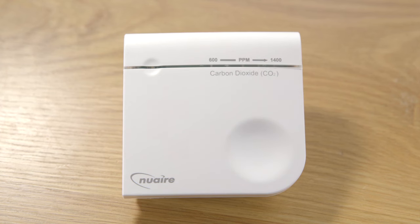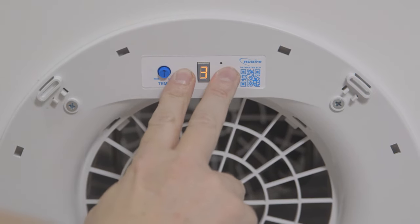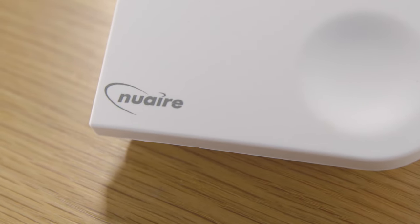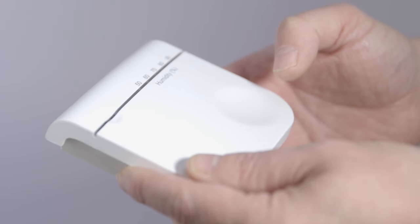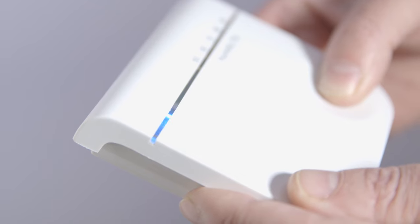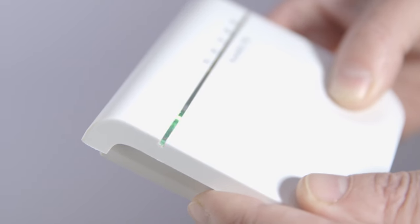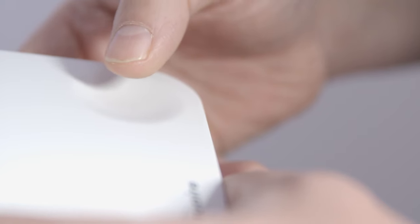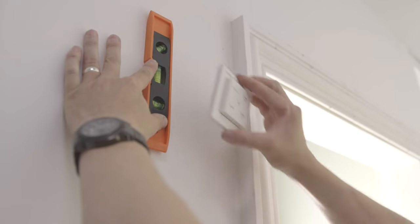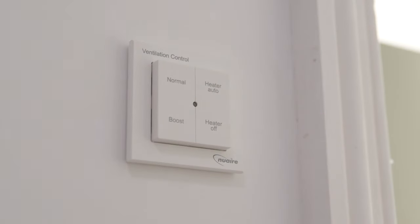If installing the CO2 and relative humidity sensors, put the DryMaster into binding mode as previously described and then apply power to the sensors. These sensors will automatically bind to the DryMaster Eco unit. Alternatively, you can bind the sensor manually by tapping the indent button on the sensor to wake it up. Press and hold — the light will flash red and blue. Continue to hold until you see the lights flash red and green. Release and then tap again. Green LEDs will appear confirming the sensors have bound to the unit. Please ensure this process is complete prior to fixing the sticky-back switches or sensors to the wall.